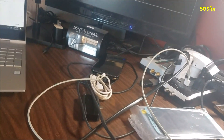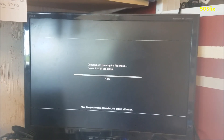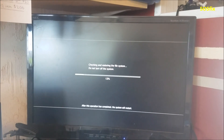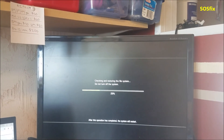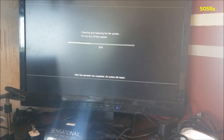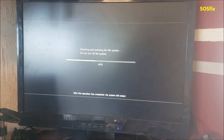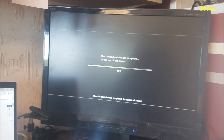At first, the display was going to the AV port with the video cable, not to the HDMI. After finding shorted capacitors pointing to the HDMI chip, and confirming the short was inside by removing the chip, I installed the replacement. As you can see, the PS3 is now working. Thank you for watching and please subscribe.